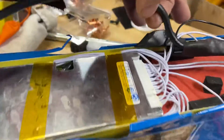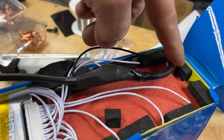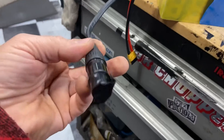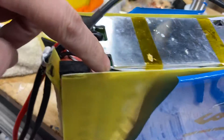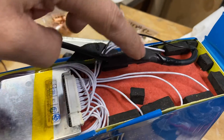That's why it's called a bypass — it goes around the BMS and then connects to the battery negative thick wire. Now if you trace the charger, it still goes into the BMS, and then it continues and joins on the other side of the BMS, between the BMS and the battery.